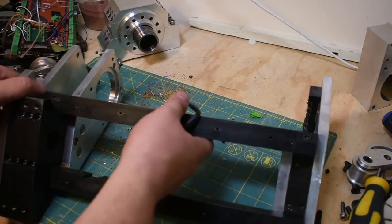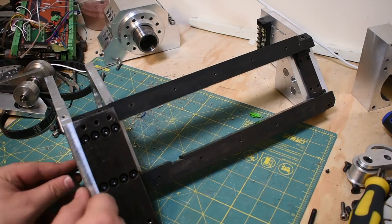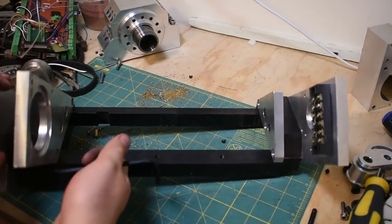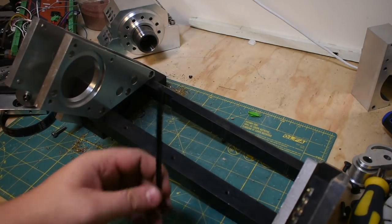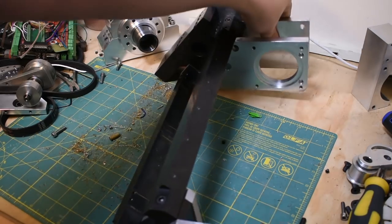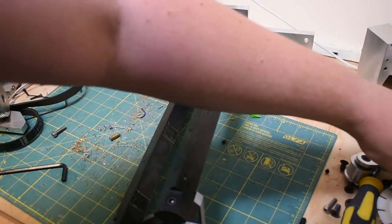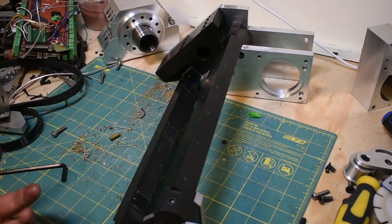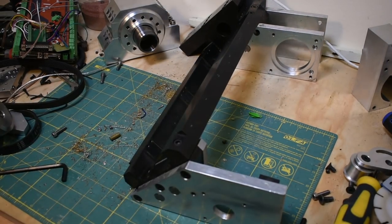Because as far as I know, without extreme power input, like three-phase power and stuff, I don't think there's any motor out there that I know of that can do that. To get a little bit off on a tangent, the more voltage you have available to you, the faster your motor can go, because you can get over the impedance of the motor coils. Motor coils are basically coils of wire, and they have what's called impedance, which is sort of a capacity to produce magnetic fields. Making them create magnetic fields, which makes the motor rotate, requires voltage. And if you don't have enough voltage, you can't make the magnetic field develop all the way. So your speed is basically limited. That's extremely true with brushless motors, of which stepper motors are, for example, technically.